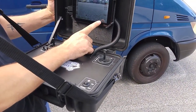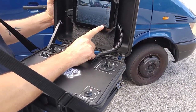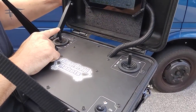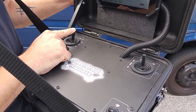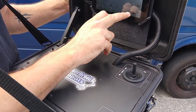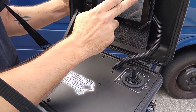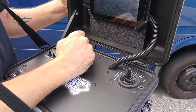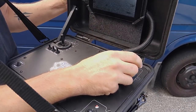While having the on-screen display up, you'll have an indicator of the flipper arms on the robot. Moving the flipper arm joystick in the right direction will move the flipper arms downward, and you'll get a degree display from the zero position, which is park. You can also press the park button to return back to that zero position so you can drive uninterrupted.